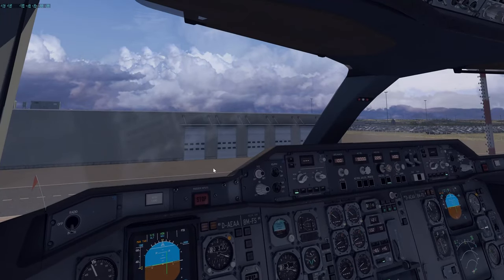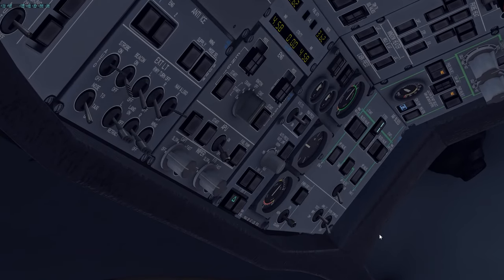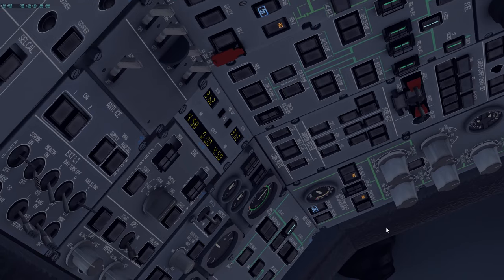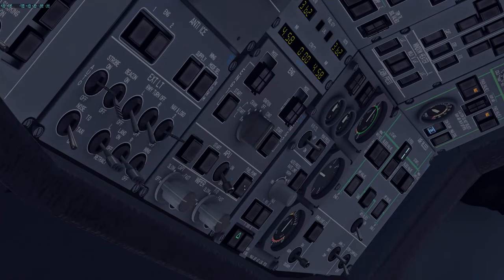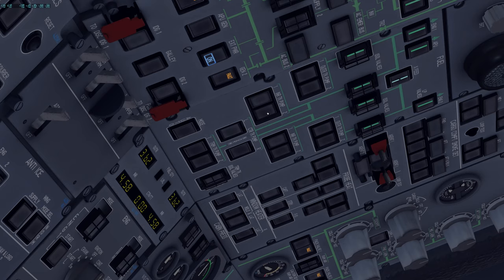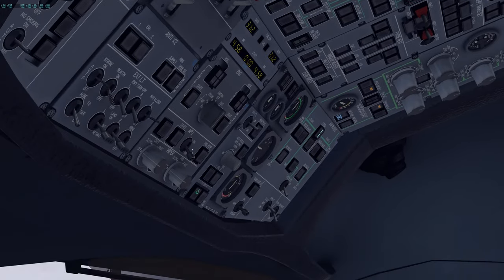To start the APU, it's very simple — pretty much like any other Airbus. There are two things you need to manipulate before starting. You would not want to start the APU if you're still refueling. The APU does use its own fuel pump system so you don't really have to turn on fuel pumps, but to help the APU you can use inner tank one pump two. That switch would be used for the APU in case it's not already on.